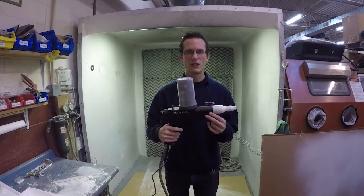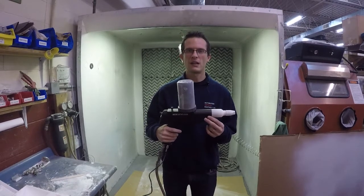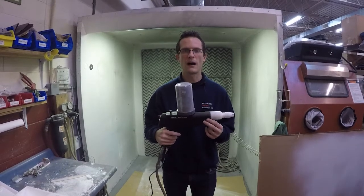The 100 kV unit here — the Redline EZ-100 over the EZ-50 — will allow you to apply multiple coats a little more effectively. Plus, the 100 kVs will allow for better wrap, so it helps keep your transfer efficiency a little higher and it'll keep your powder waste down.